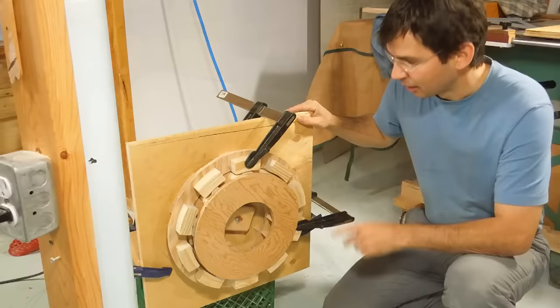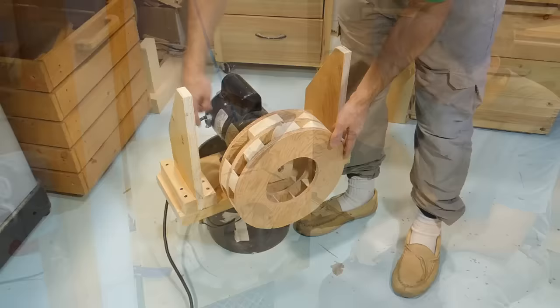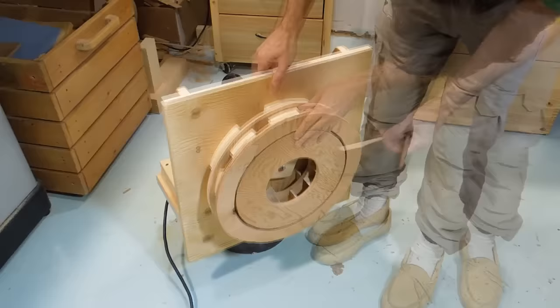It should get a lot louder once I spin up to full speed, but just with claps like that I'm too afraid it's going to wreck itself. I made a sturdier bracket to hold the stator, and I need to center that stator around the rotor — for that I'm just going to stick a few shims in there to position it before I screw it on.